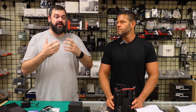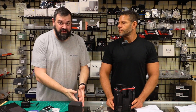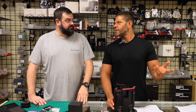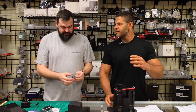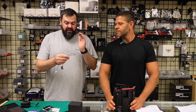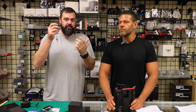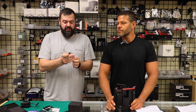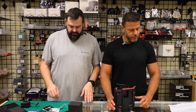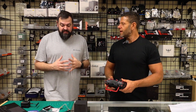This receiver is made for long-distance builds, but my ESCs are 30 by 30 and I'd have to print adapters — and I don't have the height on my flight stacks for that. So we're not doing a full review with it on a drone yet. Radio Master — if you're watching — please do a 30 by 30 adapter plate, or design it so you can break off a 30 by 30 hole pattern. That would fit everybody's builds a lot better.